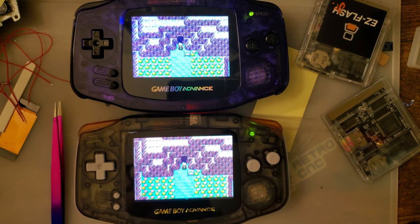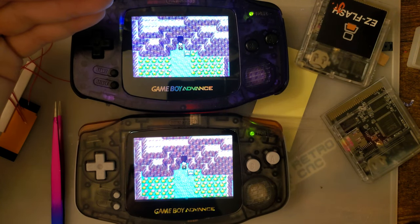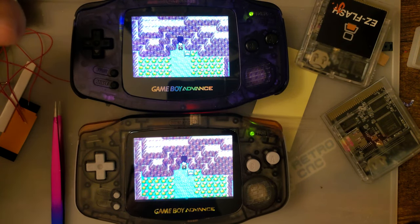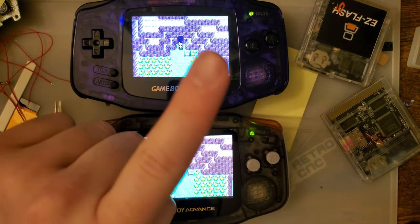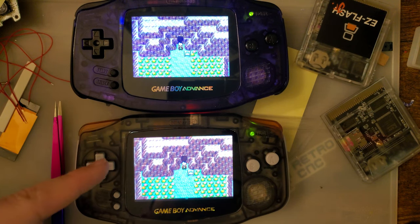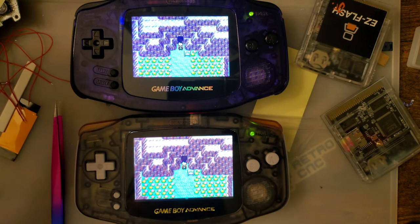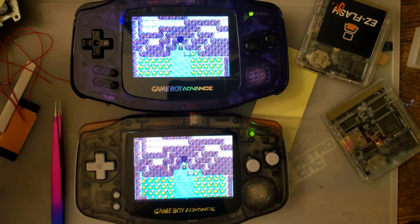I suppose I'll do a follow-up to this video because this one's getting pretty long. It's about to overstay its welcome. I'll do a follow-up where we'll actually hook it up to the TV out, because I did not do that here. And I'll show you how to do the pin 1 method, because in this kit, when I did the video for this version, I did the pin 3 method, which is quite a bit easier. You just solder to pin 3 of the link port and then you're done.